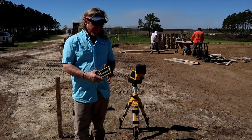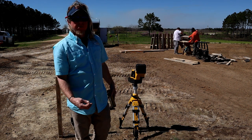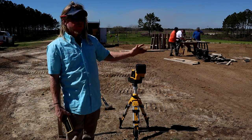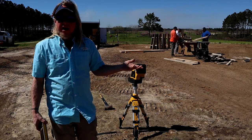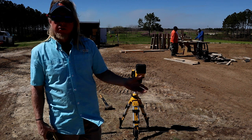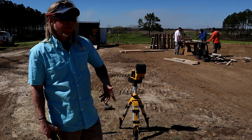What would be nice is if this thing then threw a measurement that we could laser measure, then I could go down through there and mark my measurements with my laser versus using a measuring tape. But in my last video, I showed how we elevated the piers and used the laser versus using the string. The string's just kind of a guide to set your forms, set them high. Then you come back with the laser, put it on top of your form board, and use a hammer, tap it down. You know, you start with maybe an eighth inch taller than what you need with the string, because that string may sag in this 120 feet.